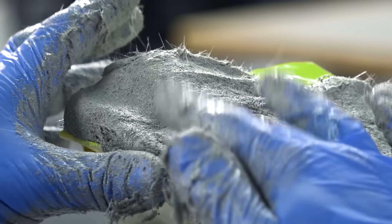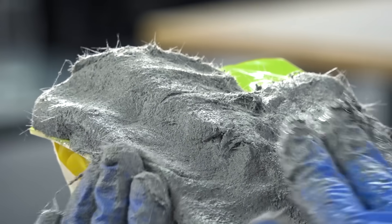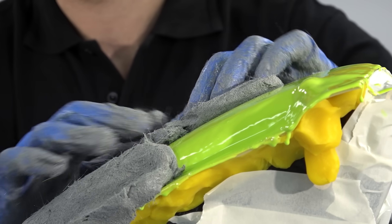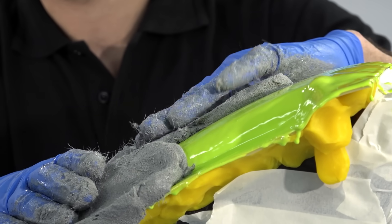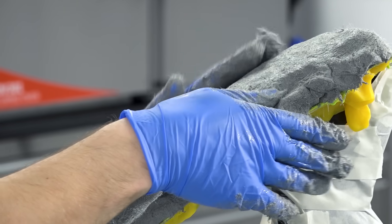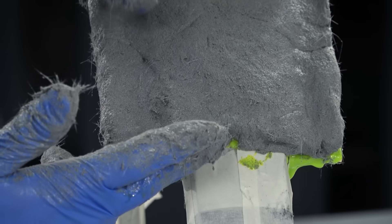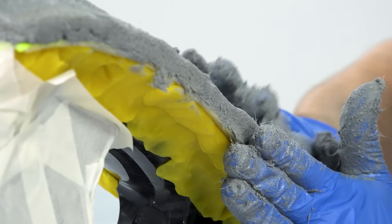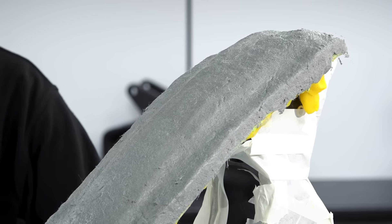This paste system is best suited to smaller moulds of up to around half a square metre. Beyond this it would generally be more cost effective and practical to use glass cloth and epoxy laminating resin to provide the primary reinforcement after the gel. In these instances it can be useful to use the putty in combination to help with filleting sharp corners or getting into finer details that might be tricky to laminate with glass.